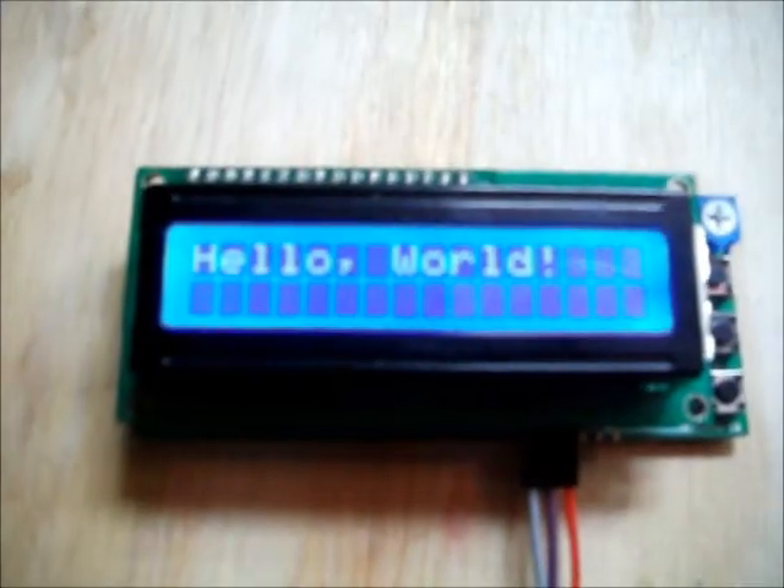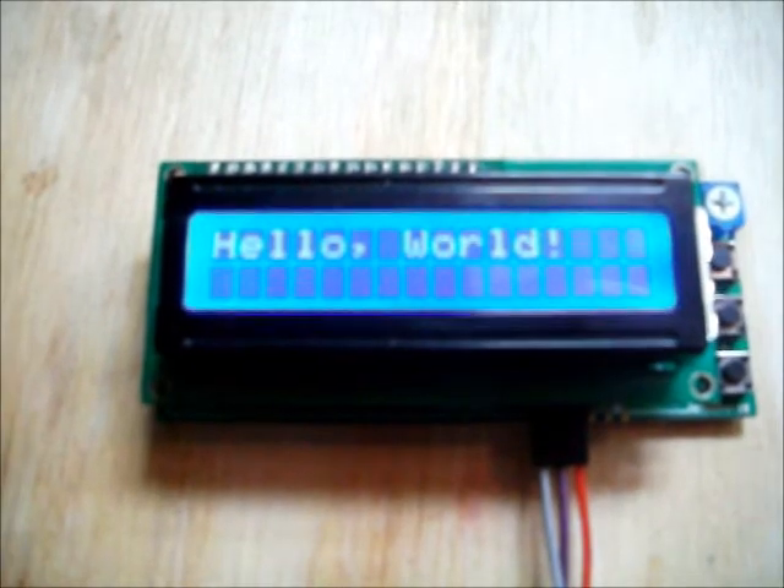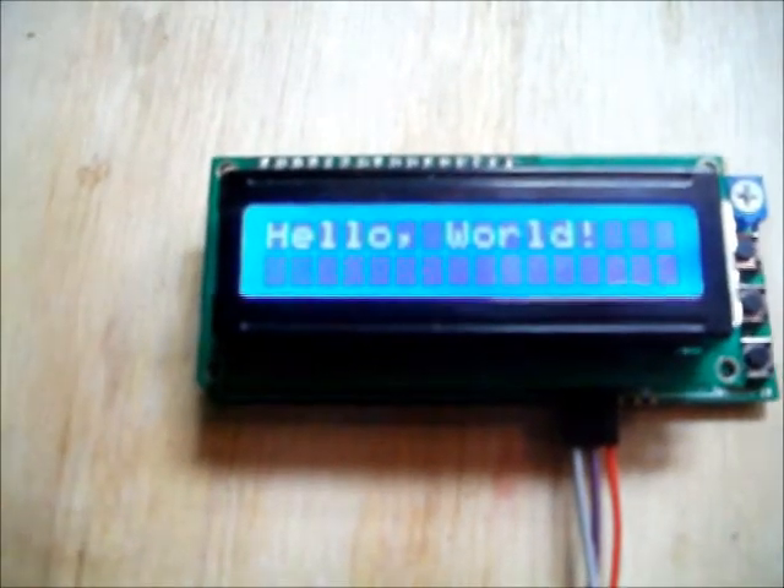Here is some text displayed on the LCD. The serial firmware chip I've created takes in data from the serial port and converts it into the parallel signal needed to talk to one of these LCDs, which is why it has 16 pins as an 8-bit parallel bus — although in my case I've used the 4-bit version.